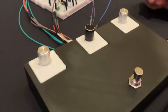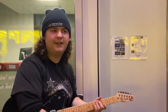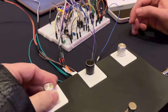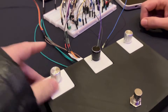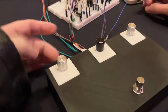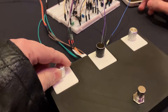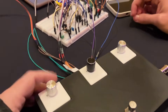Just by changing the pot value, you're changing the circuit a bit. So you can experiment without having to solder, without having to swap the pots out, and without having to know anything about electronics. If you're a guitar player and you've determined for your rig that you have a certain range that's your sweet spot, you could swap it out for a different pot, or even a pot in series with a resistor on each end, and then lock in a bigger range of control within your sweet area.